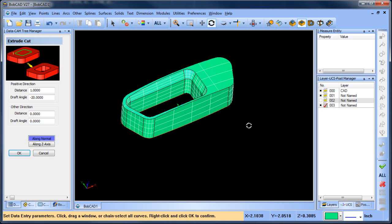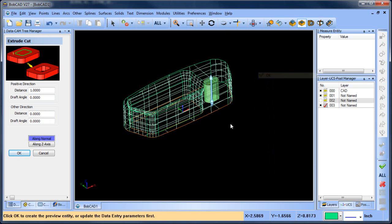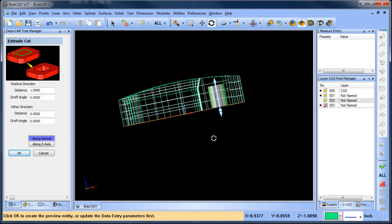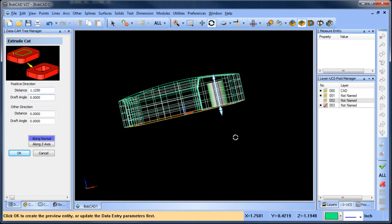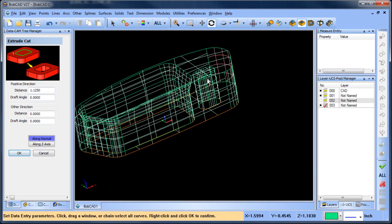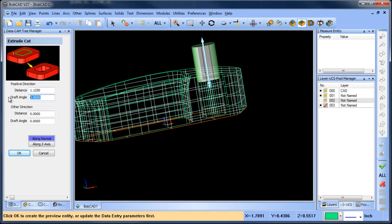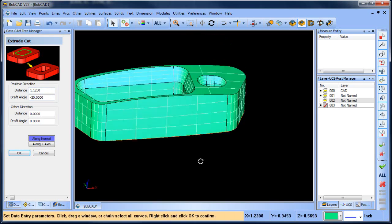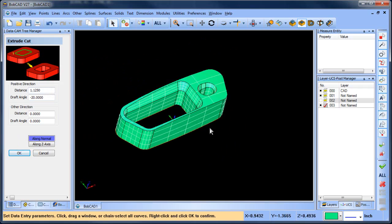From here I want to do the same thing with this other shape. I'm going to do my extrude cut, get rid of the taper, and this is going to go up to a certain level. That looks good. Then again, we're going to pick this surface edge, go up from there, and add that taper so we can get this cone shape up on top. That gives me what I'm looking for for this particular shape.